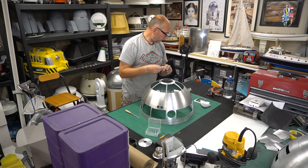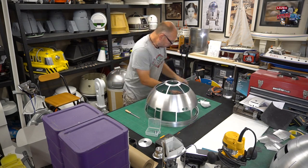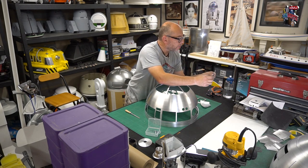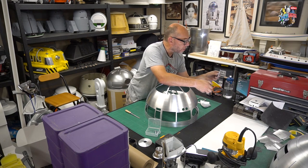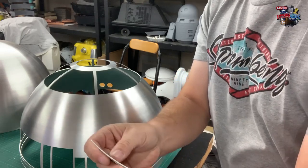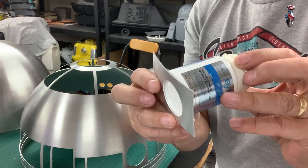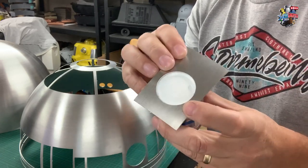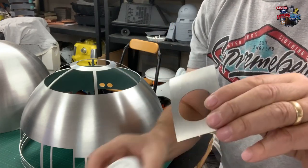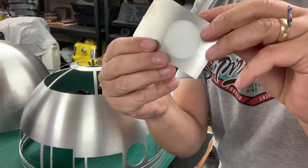Another thing I use, just so you know, is for the PSIs, which has a PSI panel here. There are various PSI display holders that hold the LED board, and what I sometimes do is have a pill bottle that you can mount the PSI LED lights onto. You put them at the back of the pill bottle so you've got a bit of distance from the edge of the dome, to allow for some diffusion. Then I use these white acrylic discs and silicone them in place like so.